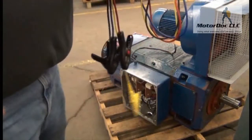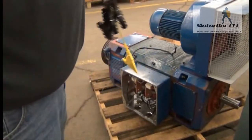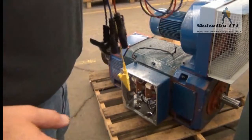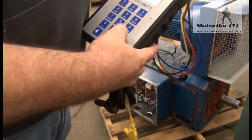For those of you with the super secret decoder ring, we're going to walk through a special method of testing this DC motor, to see if the armature has any contamination issues - a one-shot deal where I don't have to compare or trend. For this case, I'm going to go to my DC. This is a shunt wound machine.